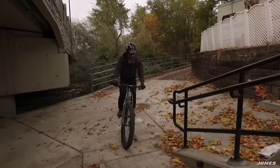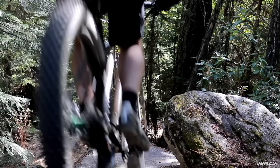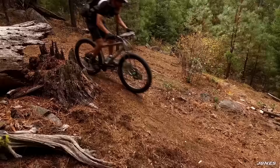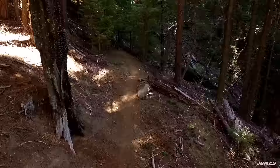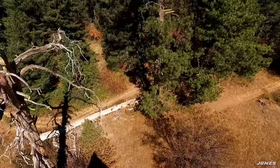The wide rim makes a really big difference. We're running 50-millimeter rims with 29-by-3-inch tires at around 10 to 15 PSI. A fat tire can absorb bumps more rapidly and more efficiently than a suspension system. Suspension may be better for a big single impact or large drop-off, but on this bike, because I'm standing in a very upright position, I have the ability to absorb big impacts too — so a drop-off is not a problem. The bike does a great job absorbing vibration and allows me to ride fast and long while staying comfortable. Going up a steep hill I don't have to fight for rear wheel traction; going down steep hills I can brake very hard and come to a two-wheel stop instead of flipping over.